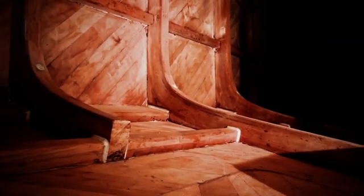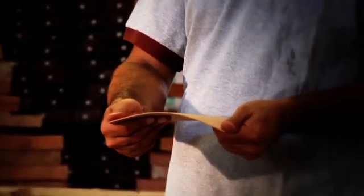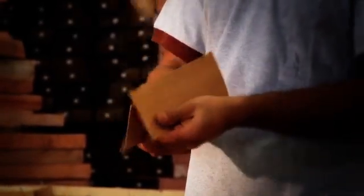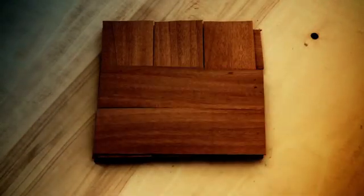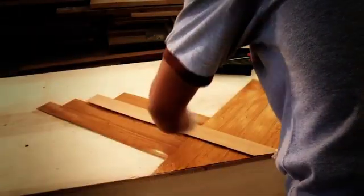There are two basic reasons for this. First, wood is a very strong material. However, this strength is unidirectional, meaning that you can easily bend the wood in one direction, but it would break if you try to bend it in the other direction. Binding together several layers of wood at 90-degree angles makes the hull much stronger in terms of dealing with the complex set of forces in effect on a boat.